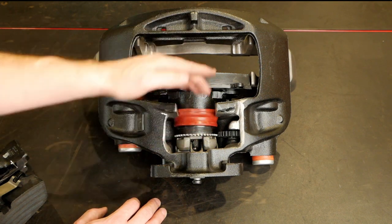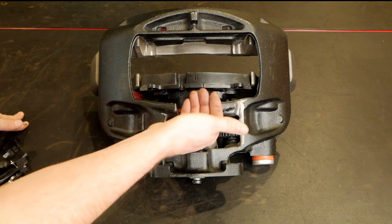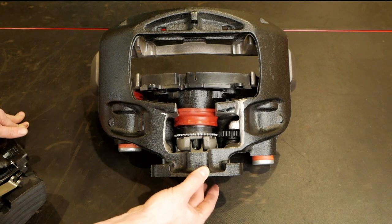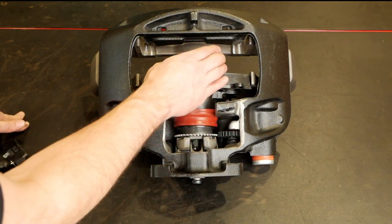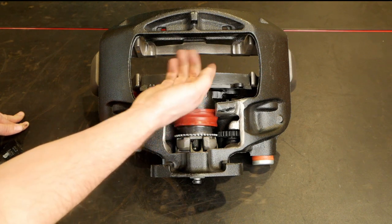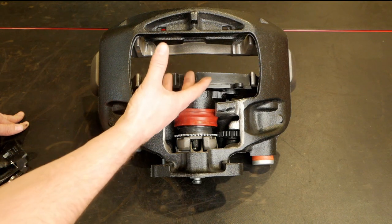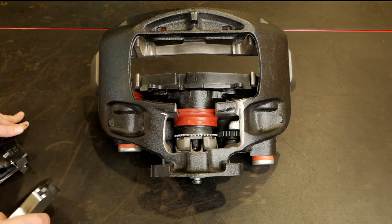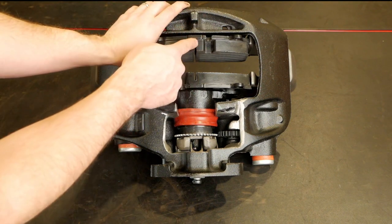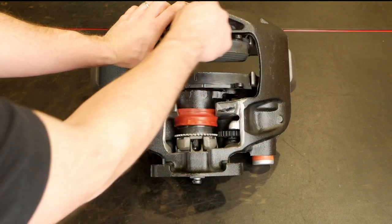It's not just one side. Looking at this brake, you might think the only braking effort comes from one side — the brake chamber pushes on the lever, pushes the brake pad in, so you'd only need one pad. But using only one pad would unevenly wear the rotor and wouldn't provide as much braking power. To get more braking power and even force from both sides of the pads, the caliper must slide on the carrier.